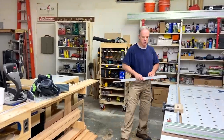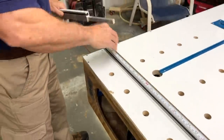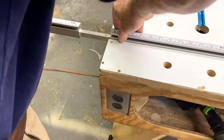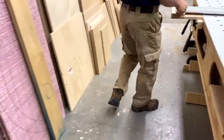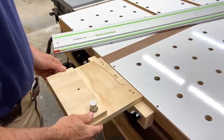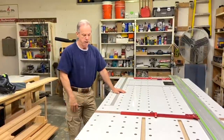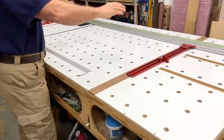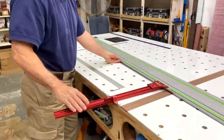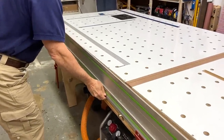I made adaptations for this system to cut large oversized pieces. I made an extension for the track with a connector — just a piece of aluminum cut on the table saw with set screws in it. I slide it in, tighten the set screw, and it's seamless. I can cut almost an eight-foot sheet. Coming around to make it wider, I made a piece that simply screws onto the side of the table and extends my track, allowing me to cut 48-inch pieces. Finally, for my long Festool track, I put pocket hole handles in the side of my table and pull those down. In between cuts, I hang the track on the pocket hole handles so the Woodpecker parallel guides don't hit the ground and get damaged.